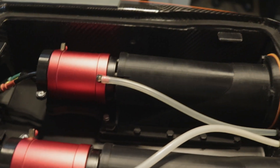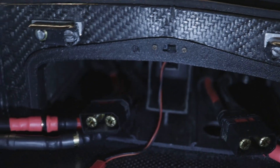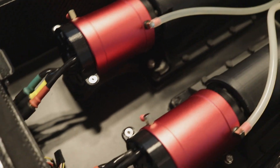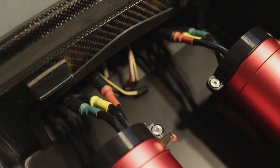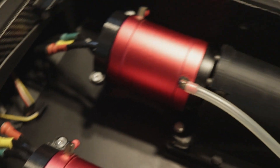The motors are now fitting. This is the easiest one to take the cover off — these covers just make that look silky. The ESCs are in under there, tucked under — you can just about see them. We've got the capacitor banks wired in now with thicker wire. They've moved under there — they used to be here with long wires going all the way to the motors, so I've got rid of that extra wire. Hopefully less resistance and heat build-up, so they're just basically connected straight to the back of the ESCs now, which should be a lot better.